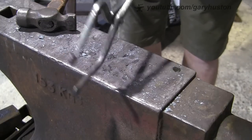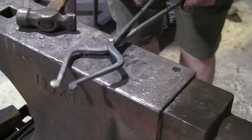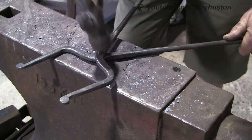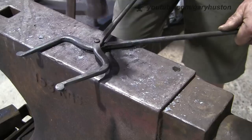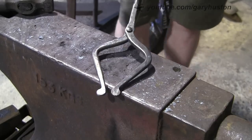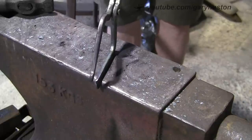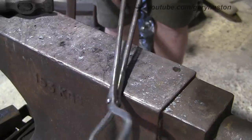So I'll just put the rivet in - I haven't hammered it up yet, I've just tapped it to stop them coming apart. We'll hammer the rivet up, then put it back in the fire and do the fine tuning, because they'll need to be set down so they come together in the middle. The reins will need to be set down a little bit so they overlap. The rivet will probably need to be tightened up even more. That's got the rivet set - you can see that they don't match properly, they overlap, so we'll get them in the fire and sort that out.